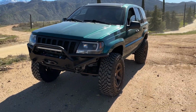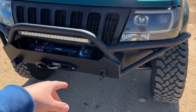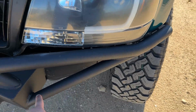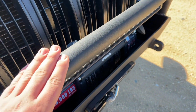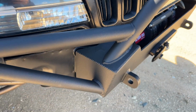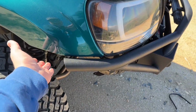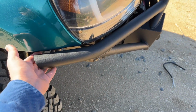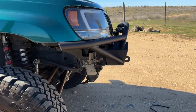I had to move because there's a car coming, but like I said, we built the bull bar first, got that angle. I mean, you guys saw the video. And we went on this side and then added the bottom piece too. And this is with that spray paint bumper, the bed liner. It doesn't have a super rough texture, but it does have a texture. You could definitely see it and feel it, and it covers really well. Like I said, I didn't go all the way just in case I trim the fenders. It'll be down to there, and I don't think the tire should hook onto this. I also did want this to stay pretty close to the Jeep, which it does, as you can tell.